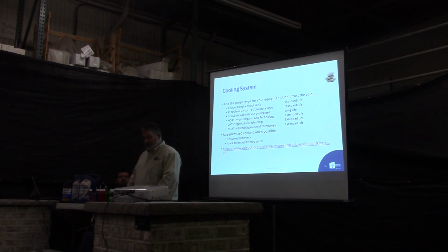Okay, I always recommend using a premix coolant. I mean, you can buy your coolant either where you have to put in 50% water, or you can buy it premixed with deionized water ready to go. The good thing about that, your guys don't have to sit there and go, well, that's about 50-50, or they'll pour a little bit in the radiator and pour a little water. Yeah, close enough. It's important you keep the correct mix in your equipment, and it makes it a lot easier if it's already premixed, ready to go, pour it in, no question, no fuss, no muss, and away you go.